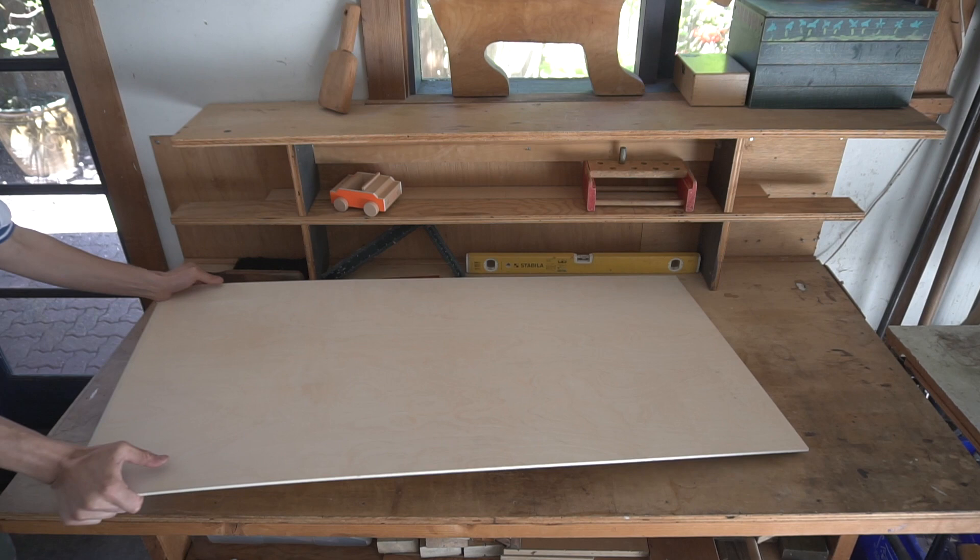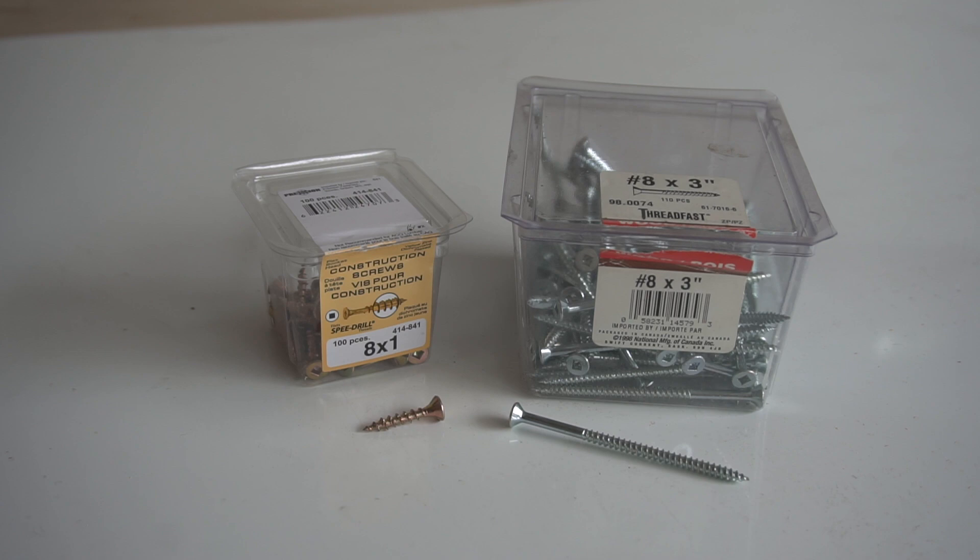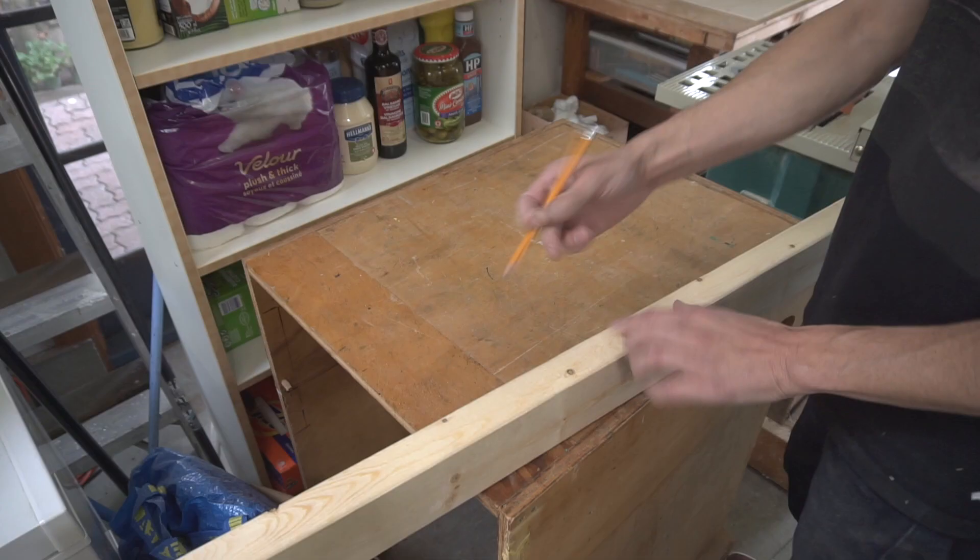In this video I'm going to show you how to make a box hockey. We need a 24 inch by 48 inch piece of plywood, two 8 foot 2x4s, a 48 inch by 24 inch piece of puck board, 16 3-inch screws, and 32 1-inch screws.